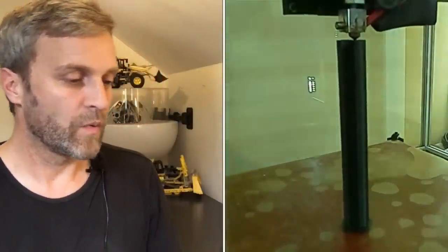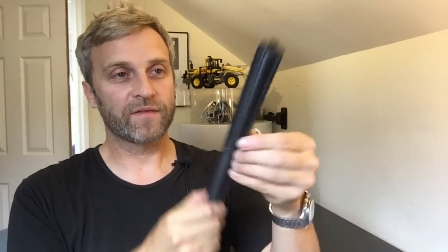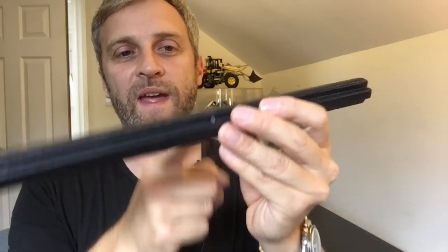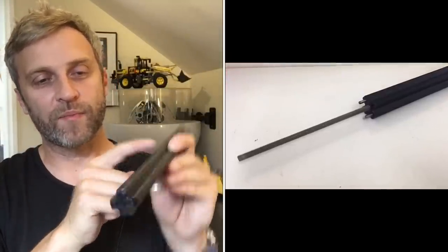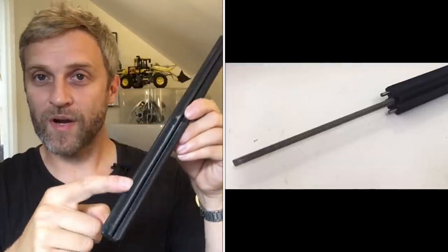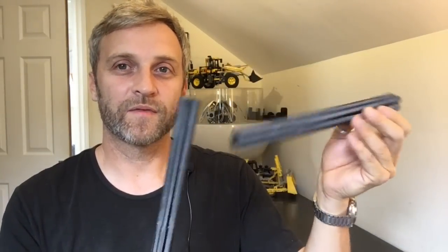I did up to a size 6 axle printed straight up on the Z-axis. The only one I had to do differently was the 8 axle — I couldn't fit that on the machine standing up. To keep it nice and round and true I printed it in two halves — you can see the join. I left it flat on the printer with slightly different CAD work: a hollow tube down the middle with a 5mm studded bar straight through for strength, plus two alignment pins so when you push the halves together they're perfectly in line. These I did at 50% infill rather than 20% just to make them stronger.